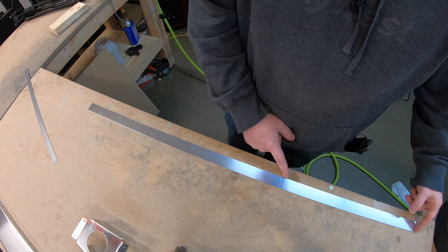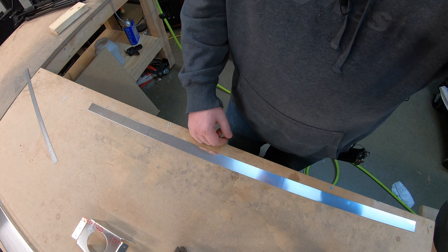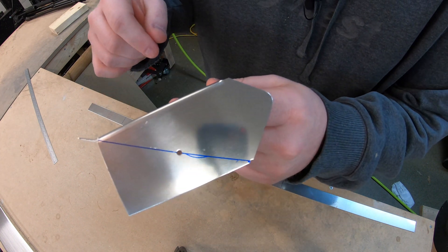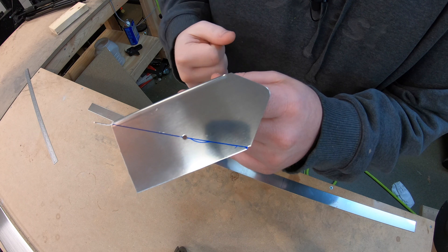I just threw the ruler up and gave myself a little bit of extra. I'm going to go ahead and get those cut down to size and trim the edges per the plans. I'm also going to go ahead and fabricate this R7-10 piece. Similar to the stiffeners, you've just got these little notches you're going to cut from notch to notch there — ends up kind of bisecting that tooling hole.